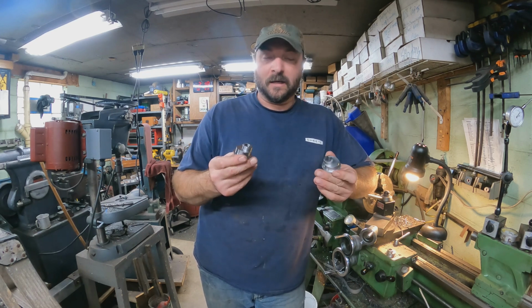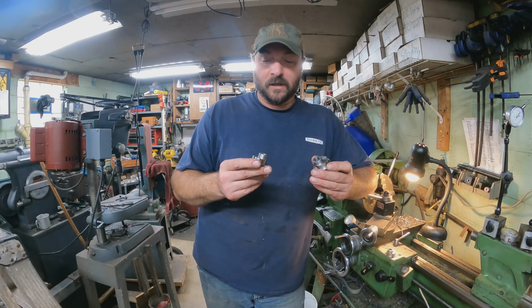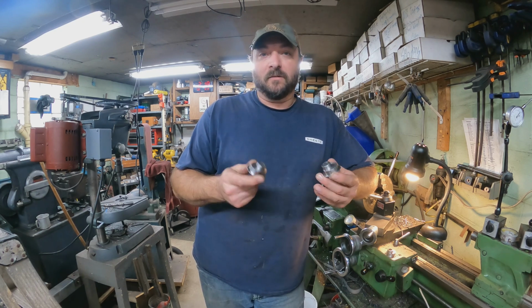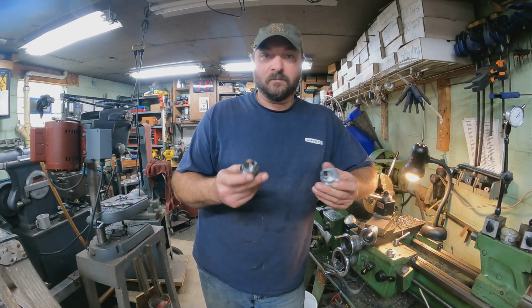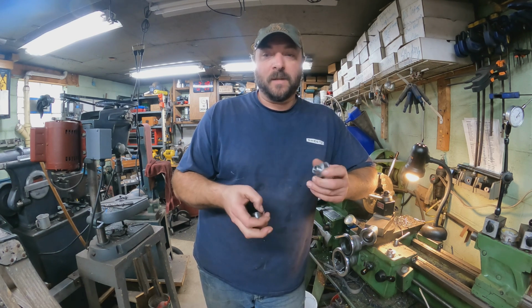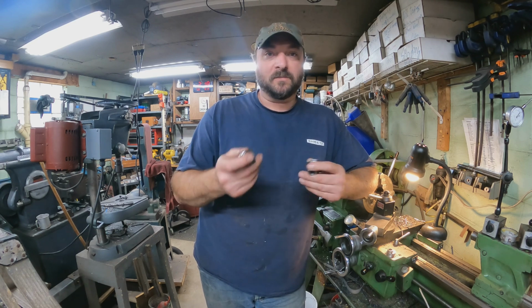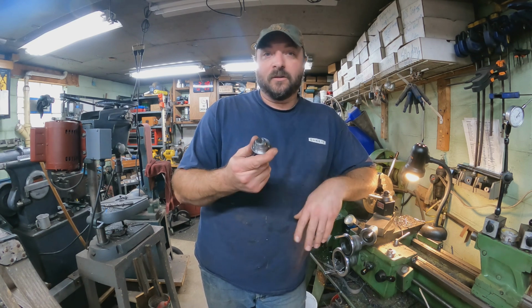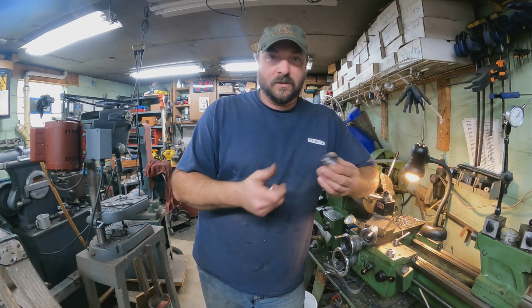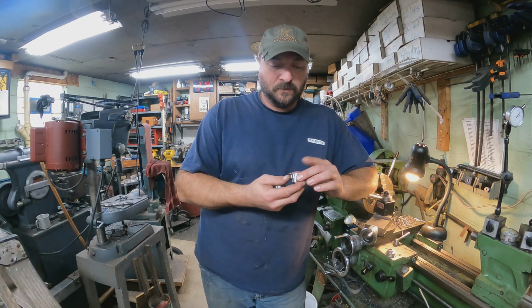There's how to do an offset, or basically these are cams in a lathe. It's not really that hard. You can make crankshafts or small little toys and whatever, if you wanted to make a small engine or something like that, you can do it this way. You can use these as cams on steam engines. You can use these for a lot of different things, if you need to.